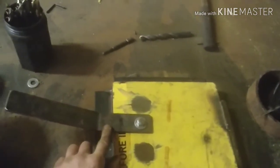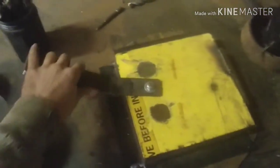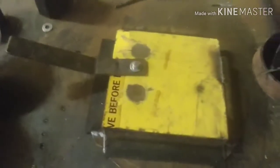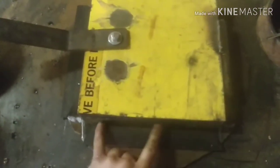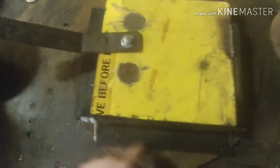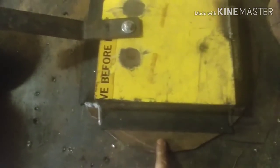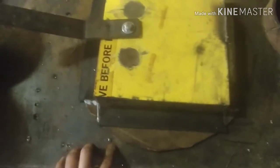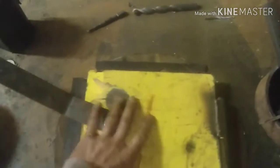And then if you wanted to tighten up the closing of the door, you just take a hammer and smack the quarter inch angle iron, and that will tighten it up — it will be a friction fit with the latch. That usually works pretty good. And I just got to figure out my draft. Normally I just blow holes in the bottom of the door or the bottom of the front plate. But since it's an oil burning stove, I want the bottom of the stove with no holes in it, so it will hold a puddle of waste motor oil, or automatic transmission fluid, or waste vegetable oil.